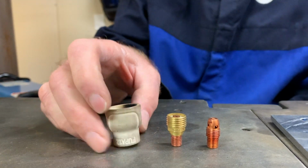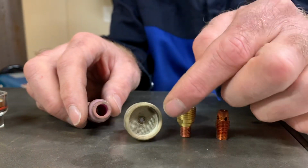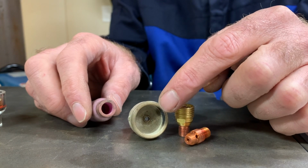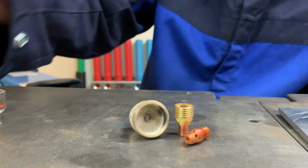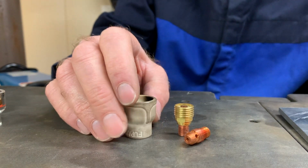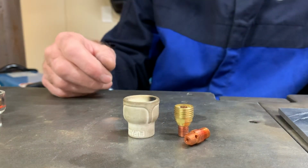It's a big cup. When you compare diameters, you can see how this cup is going to allow a larger volume of argon to come out and cover the weld area than this one. That's cool, you know, larger volume. You need that. Works better when it's not turbulent, which is why there's another screen in here to slow the argon down, make it flow smoothly.